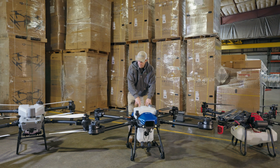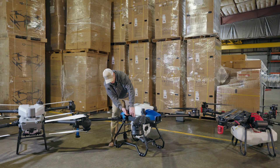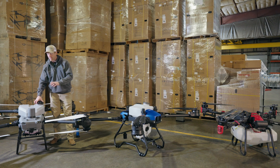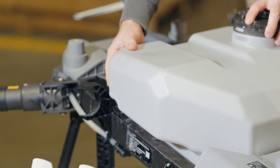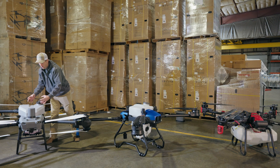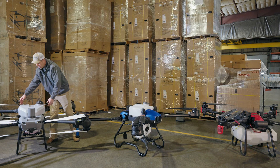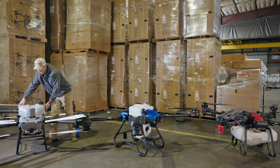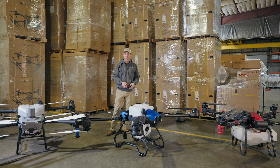The other difference between EA Vision and DJI regarding the tank mount is how the drone fits onto the scales. The J100 has four independent scale bars — two on each side. On the DJI, there are three scales: one on the front and one on each rear corner. The tank is not fixed to any particular piece of hardware; it just rests on top of those scales and can slide left or right. With 40 liters — that's 40 kilograms or 88 pounds — any shift in the tank can offset your center of gravity, which could cause big problems.